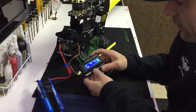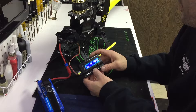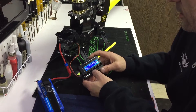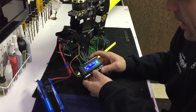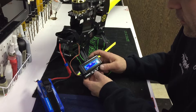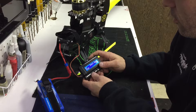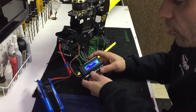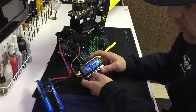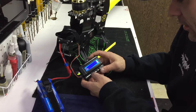BEC output will go up to 8 volts. I'm running the BK 8000s in this — they have plenty of speed — but I'll go ahead and run them at 8 volts anyway, because hey, more is better, right? The next one is startup mode, which is basically your spool-up — how soft it's going to spool up. Stock is 15 seconds; that's a little long, but if you haven't done this before, just leave it in the stock settings.